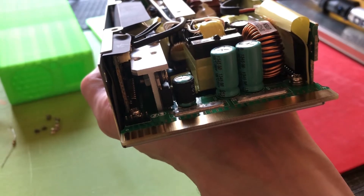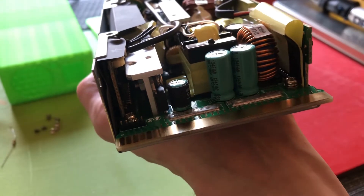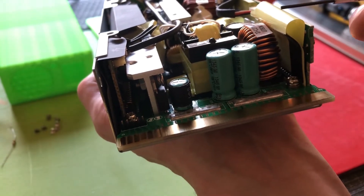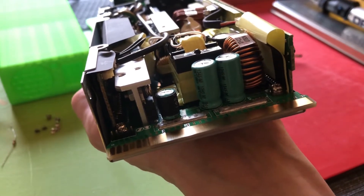We also need to put a resistor from pin 33 to 36, rated with 300 to 700 ohms between those pins, to make the power supply turn on — otherwise it will just not turn on.